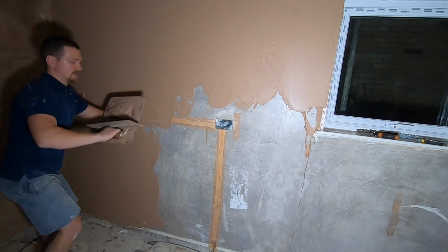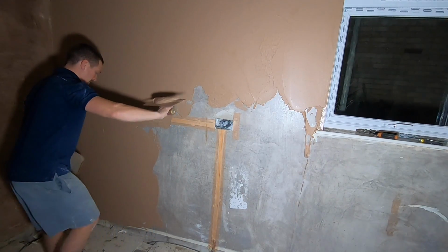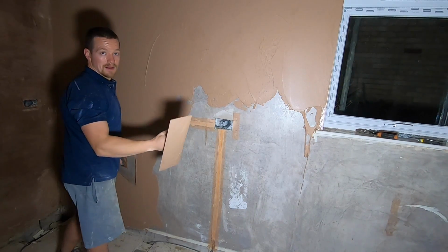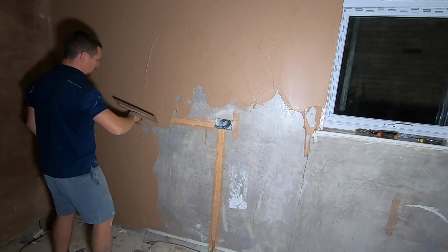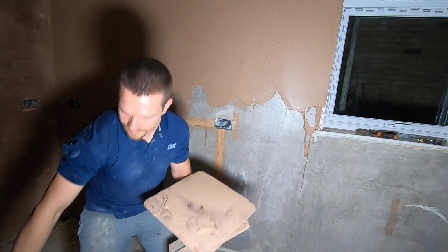And now, the next part, you want to take the plaster to the bottom of your trowel, come into the bottom, and you're coming all the way up. Now, when you start out, you might only come a third of the way. A good system is to go a third of the way, load up and start again. So I'll show you the full way. Take some plaster.